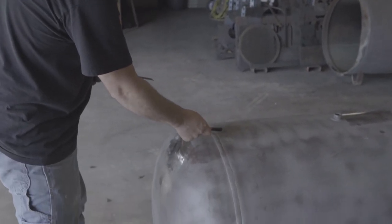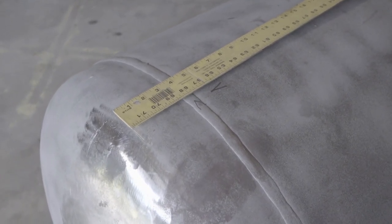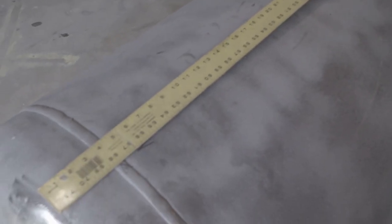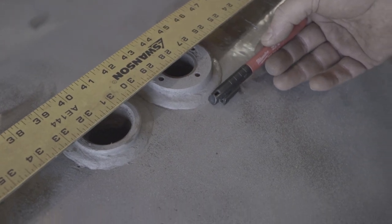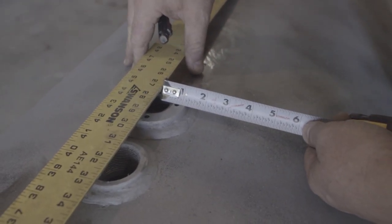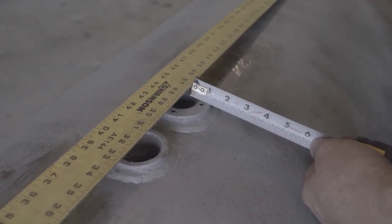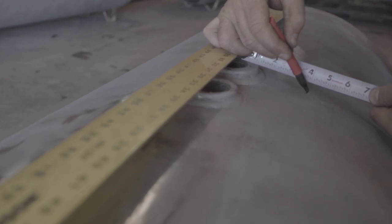Now that we know we're going to drop a line down from top dead center where we want our top door cut. We've got our arrow marks there. What I like to do is lay a straight edge piece of flat bar over your marks. I usually try to use either the edge or the center the entire time I'm marking. Then you can take this straight edge and measure down. I've got the edge of this weld a couple of inches away from the edge of my straight edge - about inch and three quarters. My process for removing these bungs is going to make me want to have at least a quarter inch clear, but I'm going to come down about four inches.